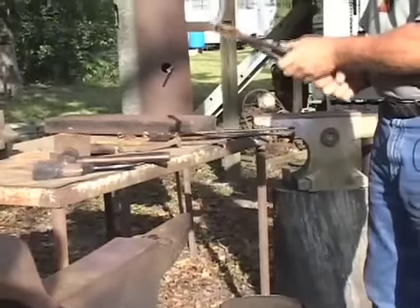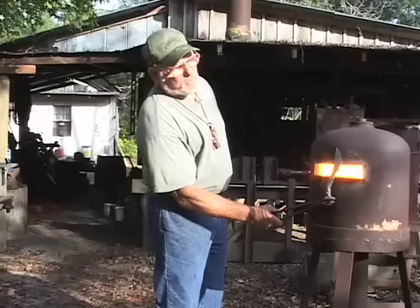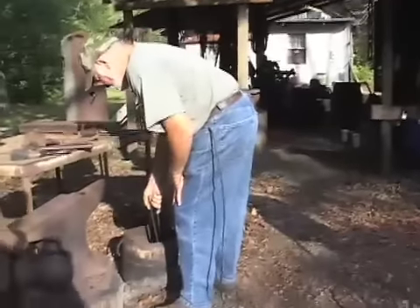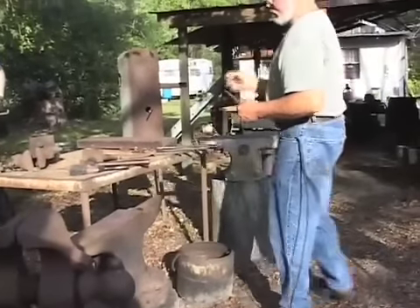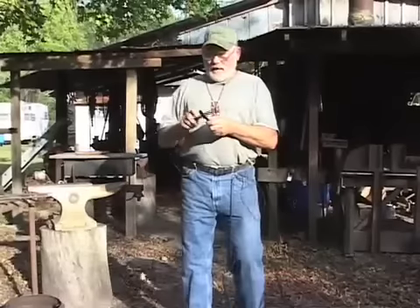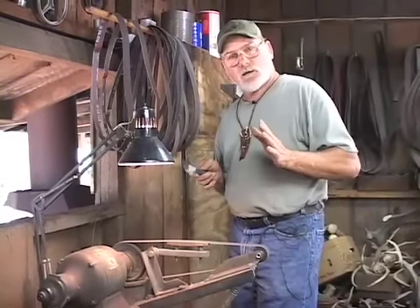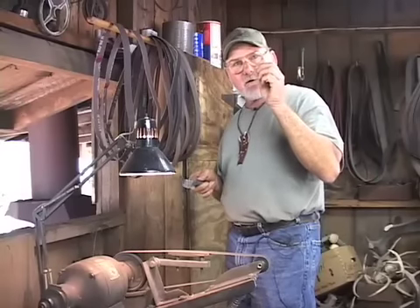This time I'll quench. The reason I'm doing it like this instead of sliding it directly into the forge is because if I slide it directly into the forge in the middle, that forge is so hot it will melt the tip off the knife. So this is heating it evenly along the edge. Now this knife should be hard — just to check it out. This is how I check it to see if that blade's hard. It is hard, that's the way you want it. If you compare the sparks off the knife this time compared to last time, the sparks are smaller and finer. That means the knife is hardened.